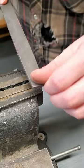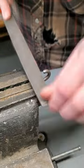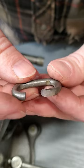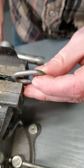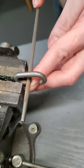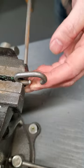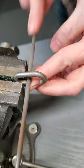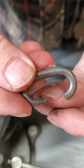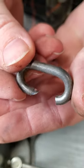I'm just filing this down so that it's at a little bit of an angle — you can see that right here. The key to making this bottle opener work better than almost any bottle opener I've ever used is by filing a hook into it. You can see how this thing just hooks right under my fingernail there, which means it'll get right under a bottle cap nice and easily.